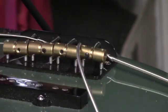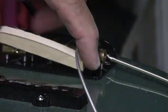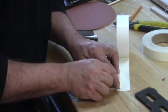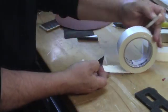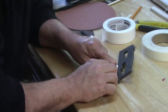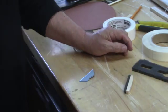We're almost there. Before I go to the next step, I want to get a sense of how high the gauge needs to be. If I set it on the plate, that's pretty good. If I set it on the guitar, I'll have enough room to put that foam on the underside. Next step, we've got a piece of two-sided tape that we're attaching to the inner side — there's our little gauge. And then finally, I have a piece of foam from my LR Bags pickup package, the right density and right thickness. Just trim that off. Voila! We've got our self-adjusting radius gauge.